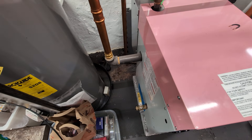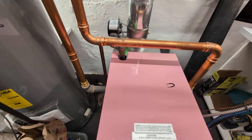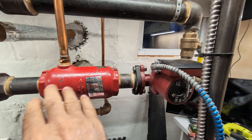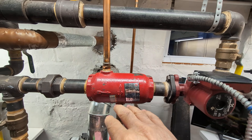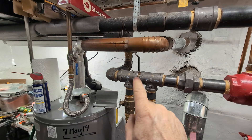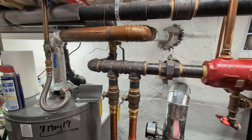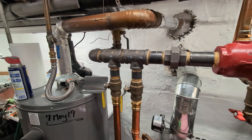Then there is another circulator which moves the water around through the main pipes and into the radiators and so forth. This injects hot water, and most of it is then circulating through the system. The boiler is never given any more water than it can really handle, so it comes up to temperature relatively quickly.